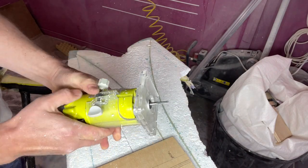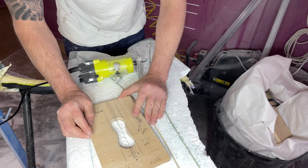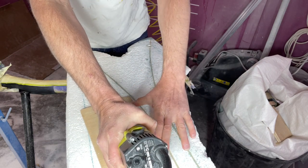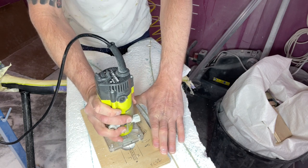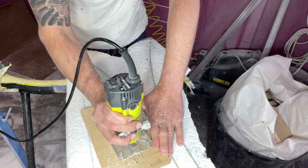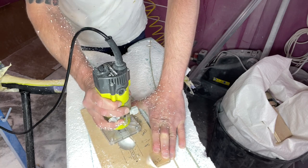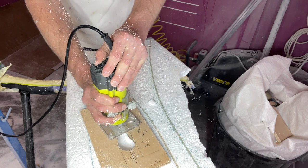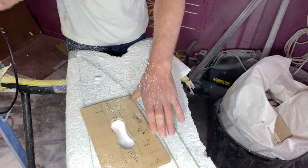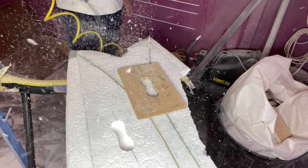So I'm just setting my depth and tightening up my clear sliding trim base. Safety is paramount here guys - I like my fingers. Just slowly tilt your router in and take the utmost care. Slow and steady, and just follow the inside of your jig. You'll have to route all of this foam out because it's only a small diameter - route a bit, just follow the inside of your jig plate. Turn your router off and wait for that bit to stop spinning before you take it out - you could destroy your board, you could destroy your fingers. Get rid of any debris - blow it away, brush it away, vacuum it away.